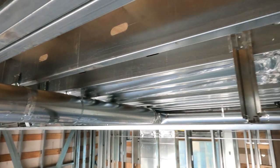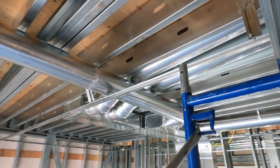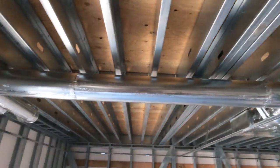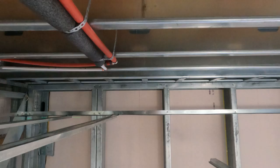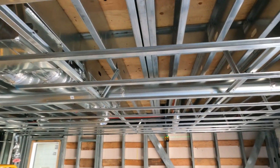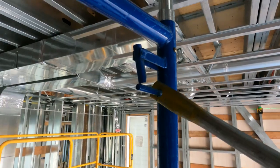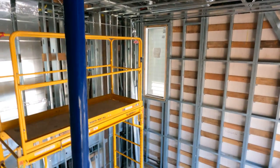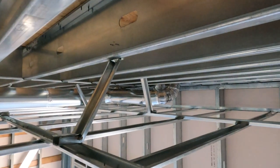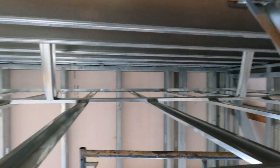When you've got a ceiling bigger than 12 feet — the length that the furring bar comes in — you need to get a center brace close to where the 12-foot end lands. Get one of your bracing runs done, secure and level, and then you have a place to clamp your furring bar. I also draw my 16s on that bracing run. Get it nice and level, laser it all in, and mark your 16s on it as well. Bracing runs with kickers staggered every four feet — super strong.